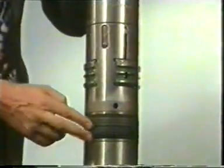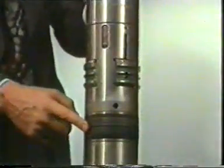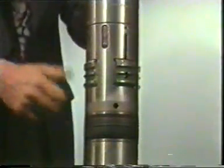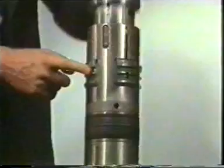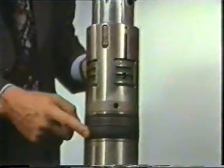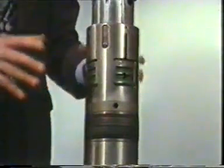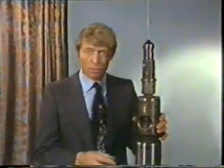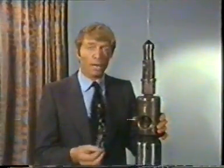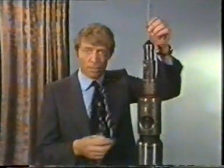What happens is this: the V-packing, one set here and one lower down, energized by hydraulic oil, relaxes to match the well pressure when the oil is bled back to the tank. The dogs holding the valve in position are drawn in when the pulling tool lifts the neck. But the packing holding the ball valve in place is still very tight — it won't come loose on its own. It has to be jarred free. Below a certain depth, the operator can use the driven spool to jar it loose. But when the depth is between 300 and 2,000 feet, it's normally impossible for the operator to react quickly enough to prevent snapping the sensitive cable, so the job has to be done by hand.